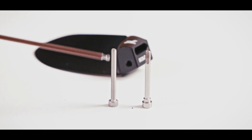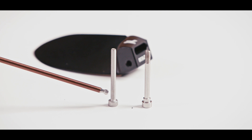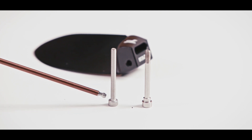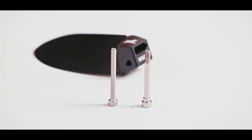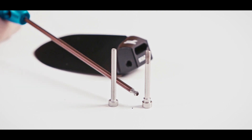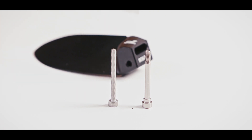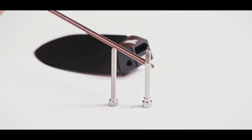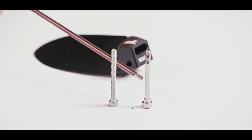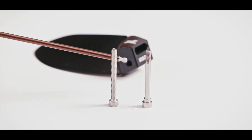The original bolts with thread on the shaft, despite being weaker, do come with the added benefit that these grooves provide a way for salt water trapped in here to be flushed out when you wash it — there are cavities all the way along the thread. When you go to a pure shaft design, which is significantly stronger, it doesn't have a self-flushing function. So please remember: from time to time, if your propeller blades feel like they're sticking or getting a little grabby, wash your system out to get rid of any salt crystals trapped between the bolt shaft surface and the inner surface of the hub, because over time those crystals can build up and create friction.